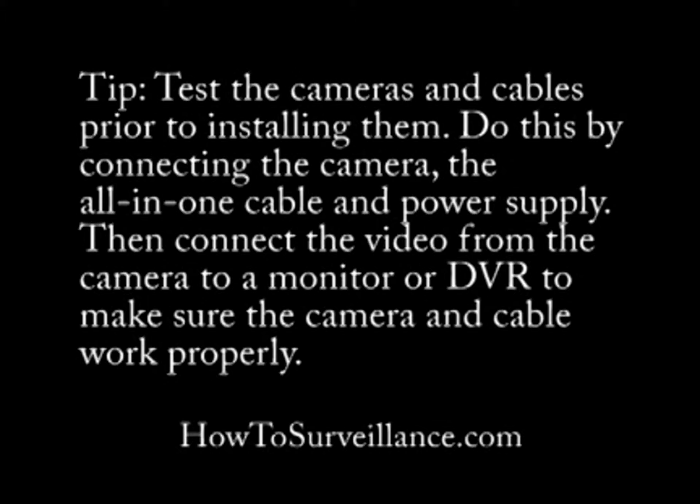One tip to keep in mind is to test the cameras and cables before installing them to ensure that the cable, camera, and power supply are in good working order. And you do this simply by connecting the camera, the all-in-one cable and power supply, and powering the camera up. And then connect the video signal from the camera to either a monitor or your recording device like your DVR, so that you can view the video signal from the camera, just to make sure the camera and the cable are working properly. And it's a good idea to do this before you install the camera and the cable.